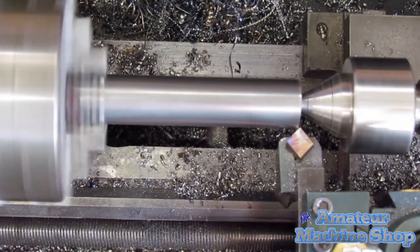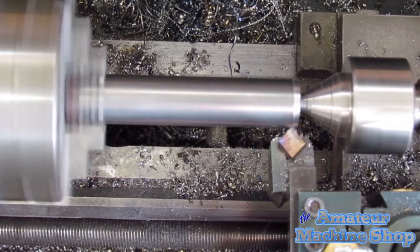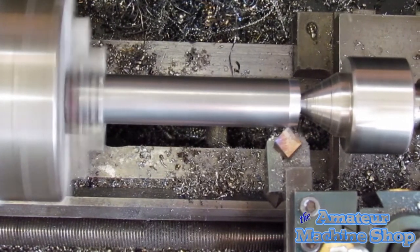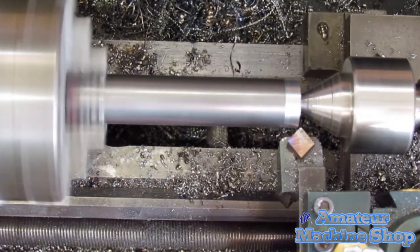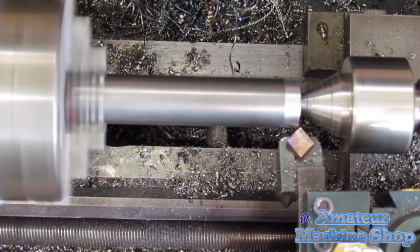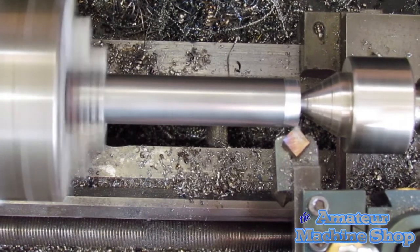Moving on to the 3/4 shaft, the initial cuts weren't all that appealing; there was a lot of chatter. It could be that the test shaft was too long and I may not have had the right grind angle on the bit. I did increase the RPM to 800 and that seemed to improve the cut, but still some chatter was occurring. If I tried to feed faster, the lathe simply cut out.